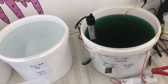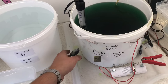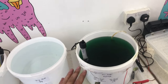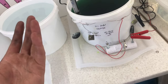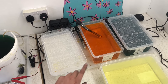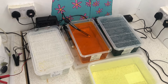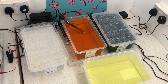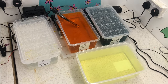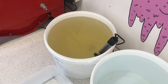Next is the zinc-nickel electrolyte, heated to about 30°C. You've got zinc and nickel anodes with a power supply running through it, all connected to a battery charger. I usually leave that for about 30 minutes, longer if I check them and I'm not happy. Then we move on to a nitric acid dip and a yellow and clear passivate. The nitric acid helps the surface after the zinc so the passivate sticks better. The yellow gives that gold colour and the blue passivate brings it out for a clear finish. With everything up to temperature, we can start on the first process.